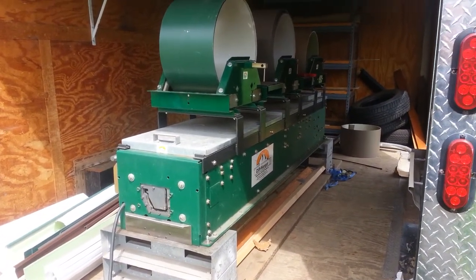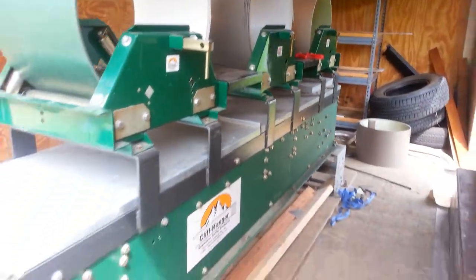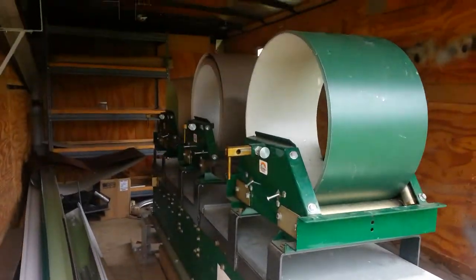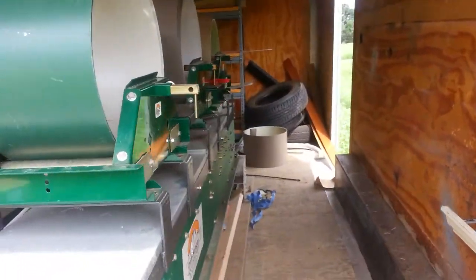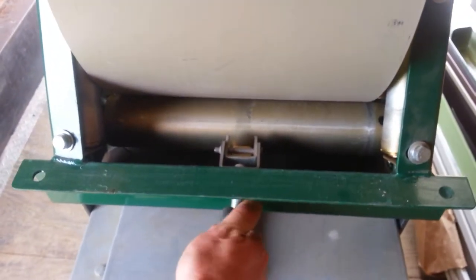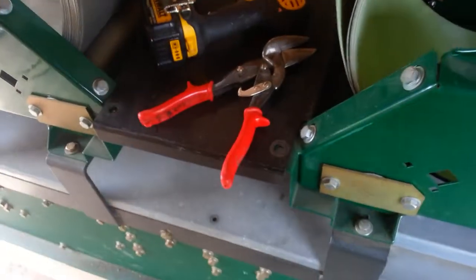I'm gonna send you a quick video here of the Cliffhanger gutter machine. You see it's got the triple coils, triple coil cradles. It's got the forward pole guillotine here — we've got three different colors in there right now. These are probably the best coil cradles I've come across. Drop a coil in here, it's locked, slide in, keeps it from popping out during transport. They've got a detent on them — as your coil winds down, crank those in and crank up the detent pressure there on the rollers. That's one of the nice features here.